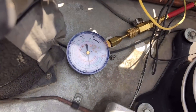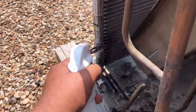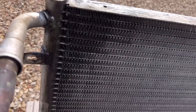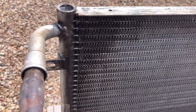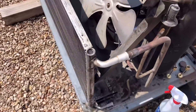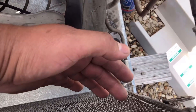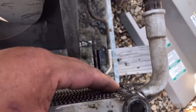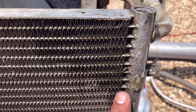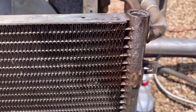We got some pressure with nitrogen in it right now, about 75 PSI. I'm still getting that leak right there that we found, but I can't find a leak up here. I've already sprayed it a few times. It is quite possible that the refrigerant was traveling up this way and maybe my leak detector is picking it up there. But it doesn't make sense — I thought I had an oil stain right up in this corner. It's a mystery leak up here, I can't find it.